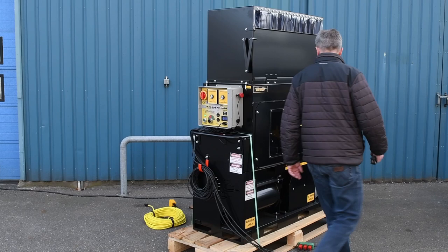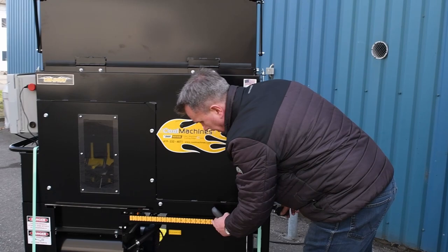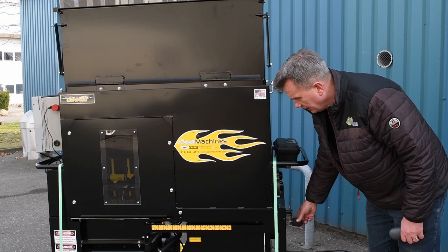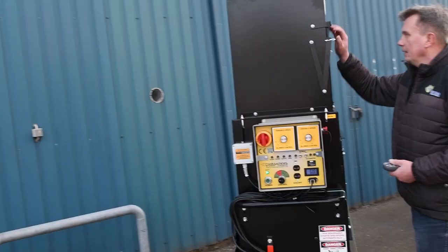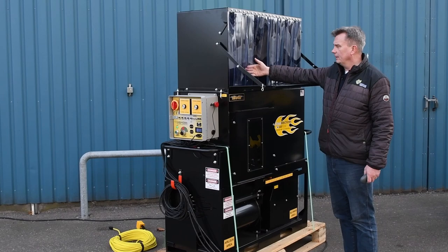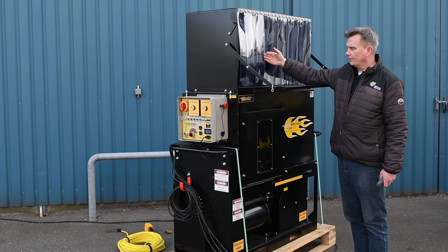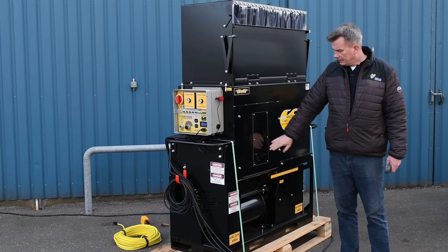The material settings are done here with the material gate. We have a handle here which you turn around, and as you can see, this is a 16-inch airlock — the biggest airlock we have — and you adjust it with the handle. You set the material gate and air speed according to the task. There is a loading tray which folds down, and you can add a curtain to retain dust from the material. There is also a glass window into the material chamber so you can always see if something is stuck.